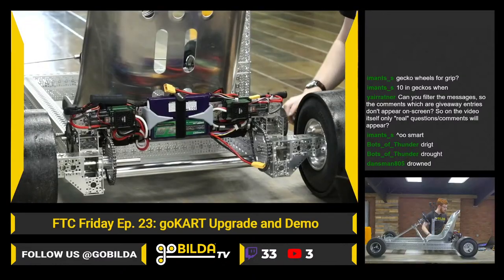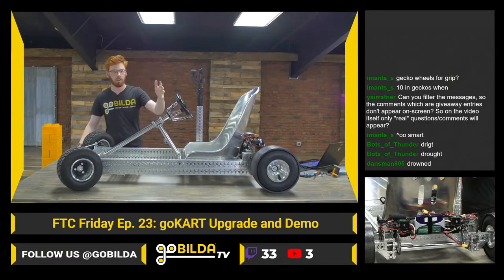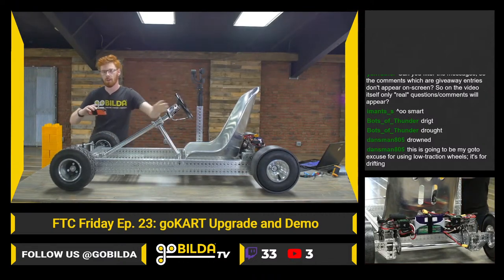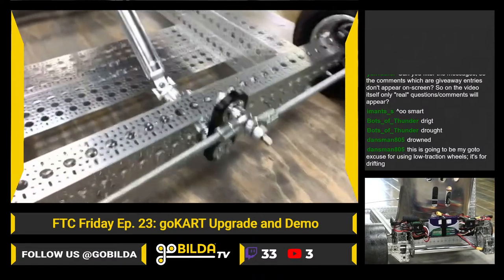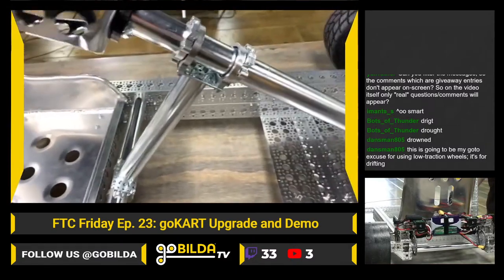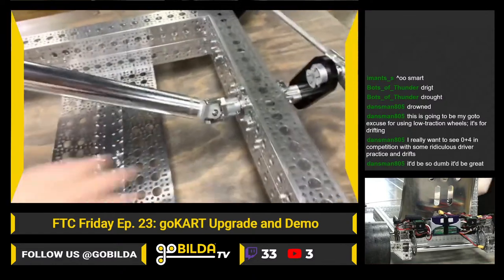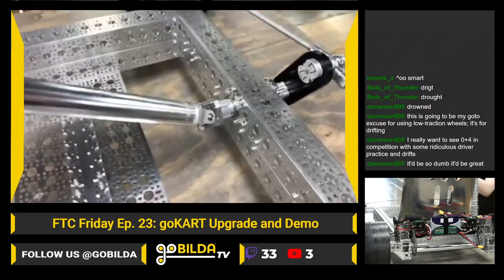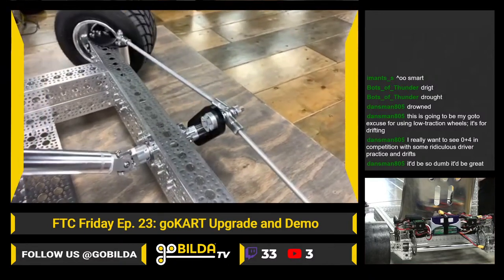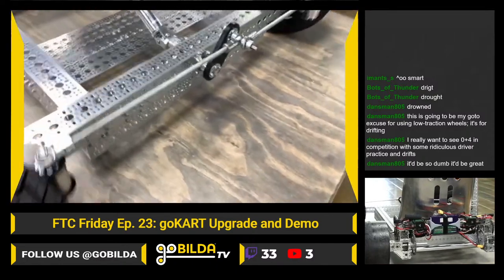With that, we can talk a little bit about the steering setup. That is a more conventional Ackermann style steering where you've got a steering wheel that will turn some wheels. We can show you guys a little bit of how that works here as well. Basically, you've got a steering wheel that is affixed to a go tube, and that go tube is supported on some bearings, runs through the length of this shaft with a universal joint. That lets us rotate those two axes, connect those, and put them at a pretty funky angle. And that's driving a lever arm that has two universal joints and threaded rods that will actually rotate those wheels.